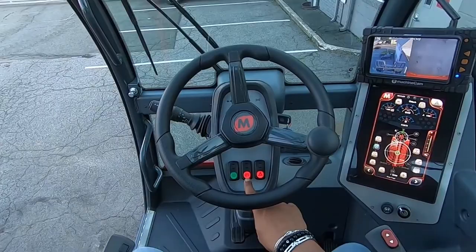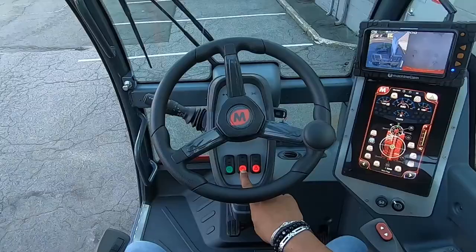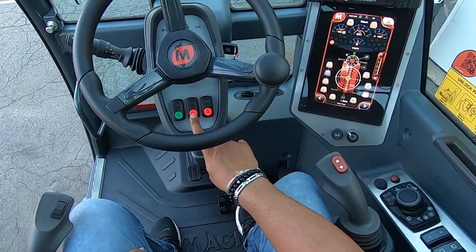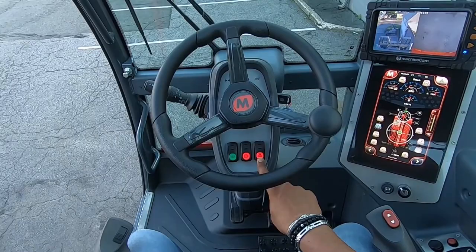Located in the center of the steering column just behind the steering wheel is a console with three buttons. Press the green button to the left to distribute the windshield washer fluid — activated for all three wiper surfaces, but the wipers will not automatically clean the windows; you must manually turn them on. The red button in the center is the parking brake. To engage it, the machine must be at a full stop, then depress and hold the button for two full seconds. To disengage, the machine must be in neutral, depress the foot brake pedal, then press and hold for two seconds. The red button on the right is used to turn on the hazard lights — press to start and press again to stop.